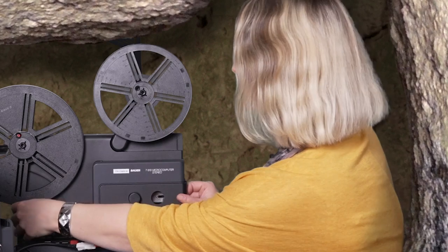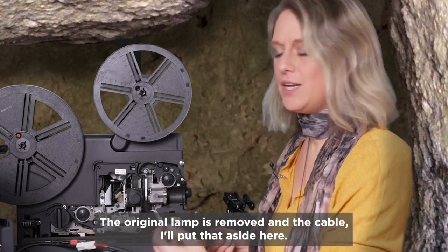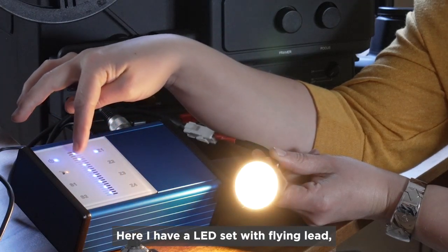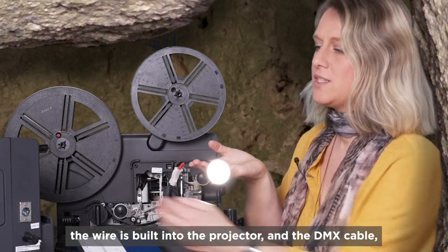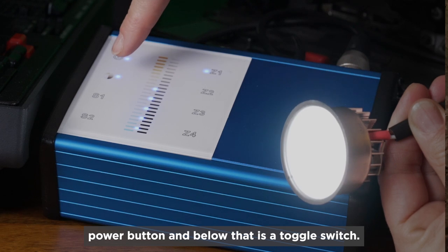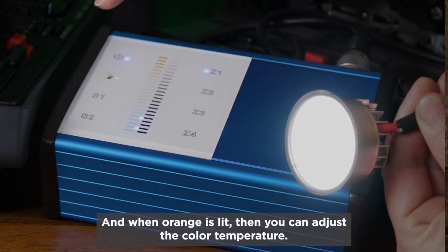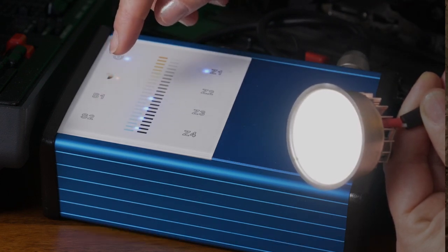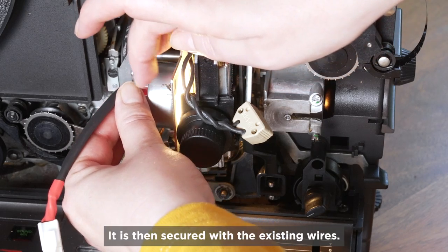The original lamp is removed and the cable is put aside. Here is an LED set with a flying lead, since a FilmDigital projector is not being used here. With the projectors that FilmDigital sells, the wire is built into the projector with a DMX cable connectable to the back of the projector housing. Up top is the power button and below that is a toggle switch. When the blue light is on, you can adjust the brightness in small increments; when orange is lit, you can adjust the color temperature to be more bluish or more yellowish. There are two memory locations for the settings. The LED can easily be mounted in the bracket of the original projector lamp and secured with the existing wires.